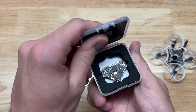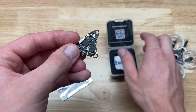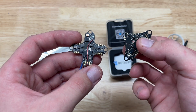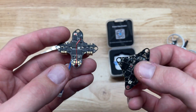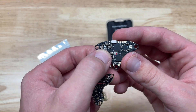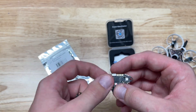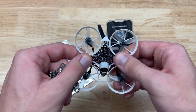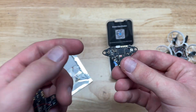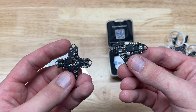Opening up this board, the G4 processor isn't the only thing that's different. You can see it's a totally new form factor from BetaFPV — we're used to seeing a cross-shaped board with four mounting points, but this one is a three-mounting-point board with more of a triangle shape. It looks very similar to the Diamond F4 board from Happy Model released a few years ago. The mounting configuration might provide more rigidity to the frame, which will be interesting from a tuning perspective.